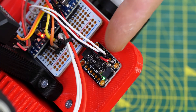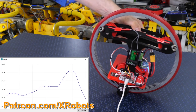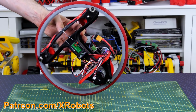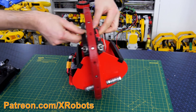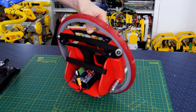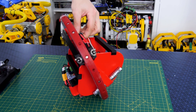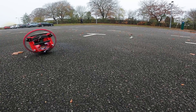So in my monowheel I attempted to add some auto stability control using an inertial measurement unit to measure the angle and then automatically control the velocity to hold the internals at a specific angle. I also attempted some dynamic side to side stability control, although the programming port of my Arduino got broken before I really got to tune it, and I think this may have contributed to making it more unstable in the end due to oscillations that built up if we went too fast, which mostly happened driving downhill.